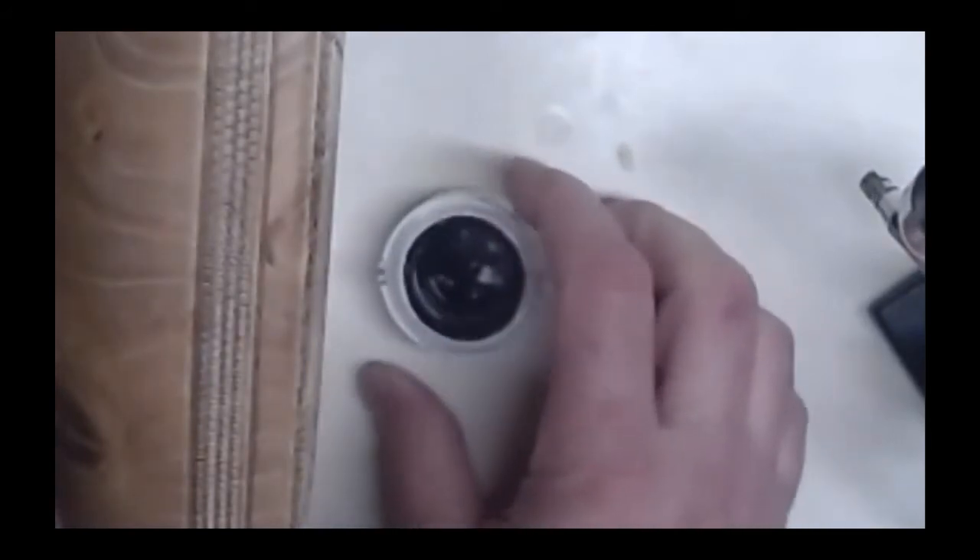The smart thing to do is get something underneath your lathe bed so you don't paint it. This is Chestnut Spirit Stain black — let me put the cap on so I don't spill it. I'm just spraying it right out of the bottle; I'm not thinning it or cutting it with anything. It doesn't take a lot. Look at the change — I'll do it this way so you can see what I'm doing here.